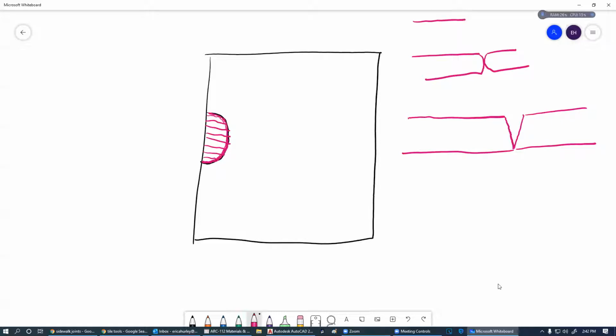And sometimes they have what's called a beaded surface. And this is basically the minimum joint allowed by the manufacturer. Okay, let's just call it that. So we've used that mortar to put these down with the dental tooth trowel. And then we've got to go through with grout.